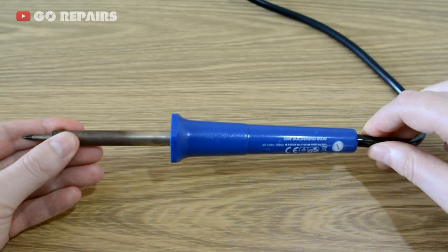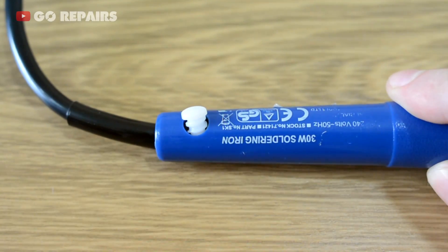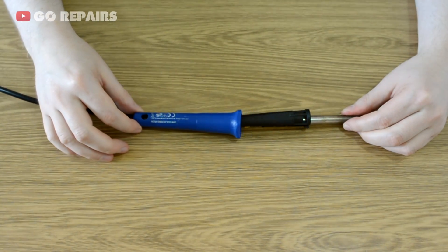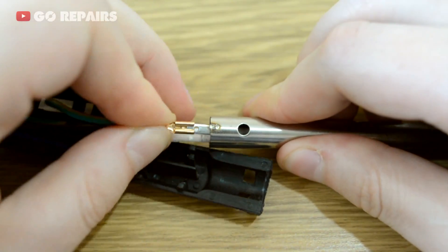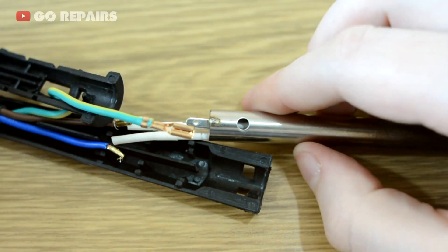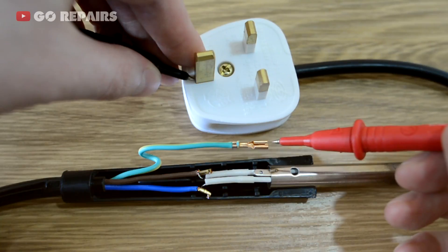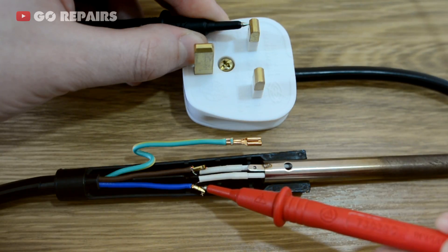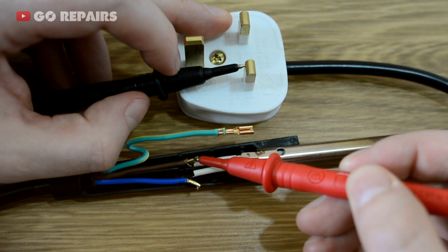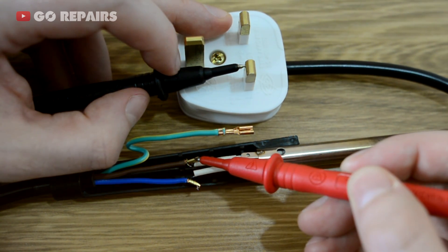To get to the connectors on the cable we have to disassemble the soldering iron case by undoing this little plastic grub screw and then sliding off the protective grip. I remove the little plastic cover before gently wiggling off the earth spade connection. We have the same three colours of wire as at the plug. I test earth at the plug and at the soldering iron, then neutral the same way, and lastly the live wire. With all three wires buzzing when I check them, I know they don't have a break in them.